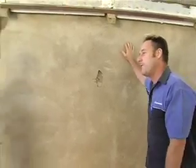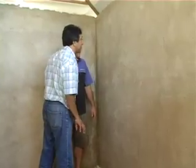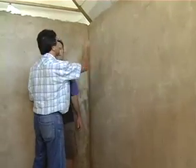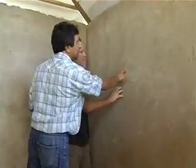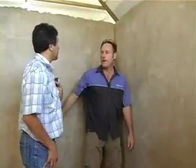What do you think about our polystyrene house so far, Chan? I think it's got good potential. I'm actually quite impressed with what I see up here. Because in spite of you giving it quite a pounding on that side, there's no effect here. The polystyrene has a cushioning effect — it localizes the vibration to that one spot and doesn't carry it across the wall or along it. We've got absolutely no stress marks or any evidence whatsoever of the pounding we gave on the other side.